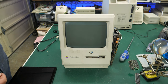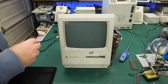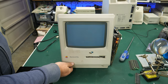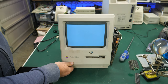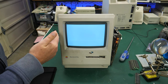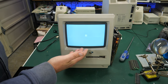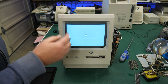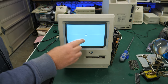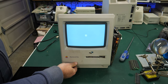Actually we're getting an image now! There must have been some cracked solder joints that I couldn't see. Is this actually working? Oh my word - this was not working at all before, guys. There must have been something screwy in those cracked solder joints. Let me get this put back together and get the floppy drive hooked up and we'll see if this is working. The picture looks fantastic!